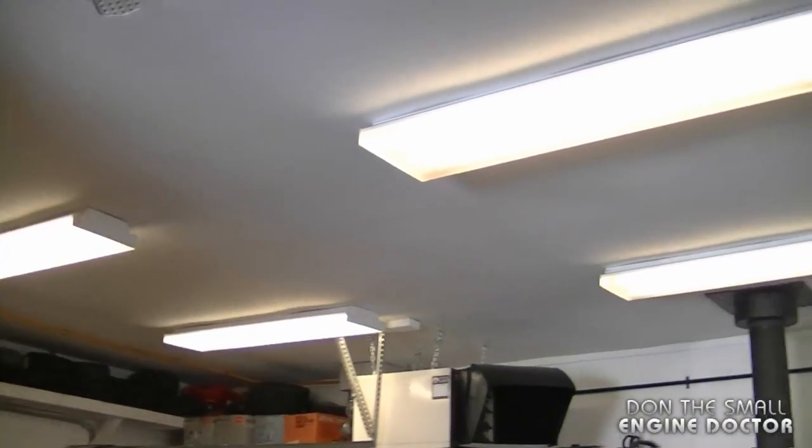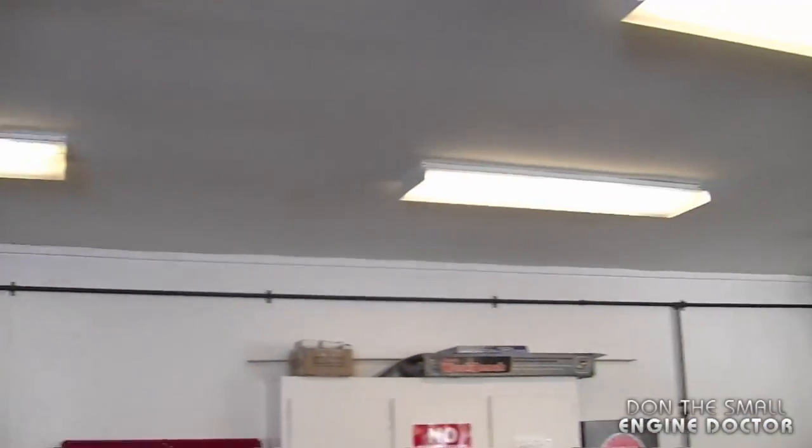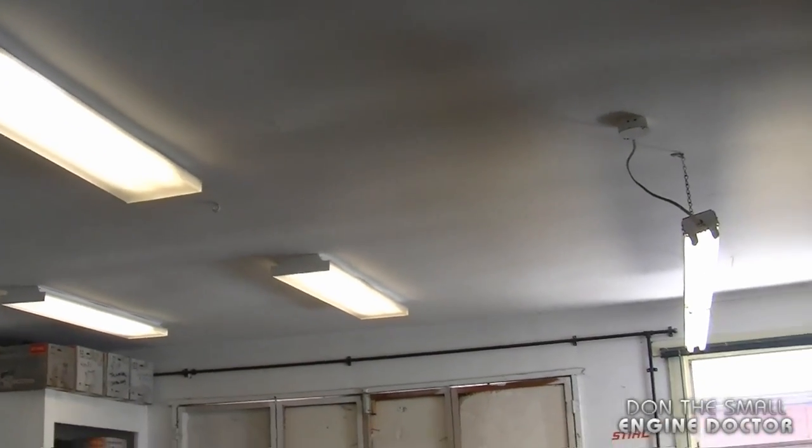Another question was about my shop lights — a viewer asked how they are for cold starting. They're pretty good; they're the new T8 bulbs, a bit thinner than the older T12s, and these are cold-start-rated lights. The ballast in your light will also affect how quickly your fluorescent lights start up, so don't just look for T8 bulbs — also look for a specific ballast made to start up these lights when it's really cold. It gets down to minus four here where I live sometimes, and when I come into the shop cold they are a bit dimmer, but they still come on. They're spaced approximately four feet apart in three rows by four rows in length, and the T8 bulbs don't hum the way the old T12s did.